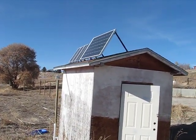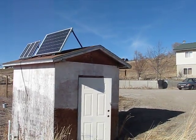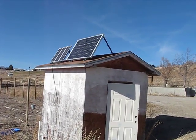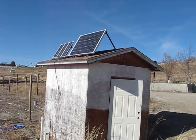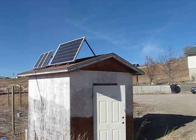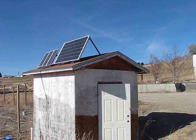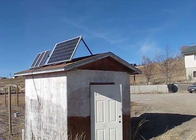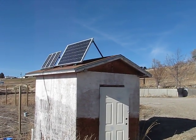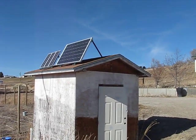As you can see on the roof, I've got four panels. Three of them are 20 watts — they're all mounted together and tied together in parallel. And then I have one that's 100 watts, just all by itself. I originally had them all hooked in, but I had two charge controllers: one that I run the three little ones and one that runs the big 100 watt.